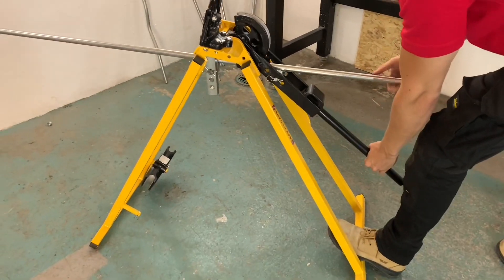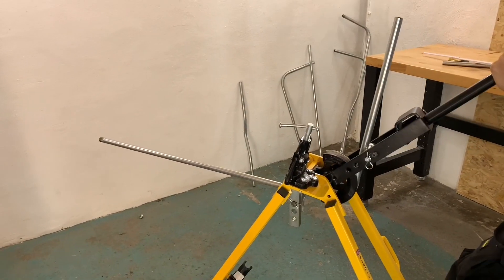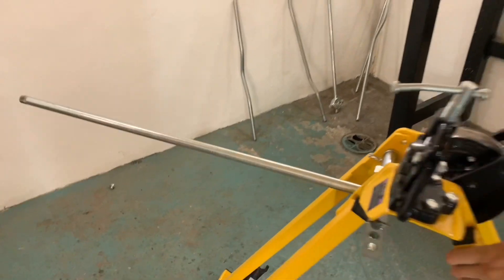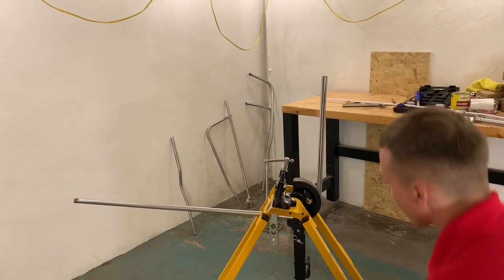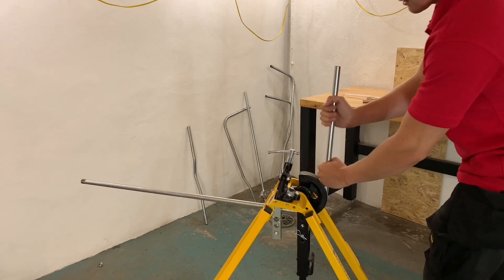Your foot's back on the machine again. You're going to bend that one up - so that should be from the back of the conduit bend to the end of the conduit at 1 metre. And if we tried to bend it the other way around, this piece here would have hit the floor, wouldn't it? That's right. So you're going to try and set that to 90. I'll step back and take a look. That looks somewhere really close, so I'll take that out and have a look.